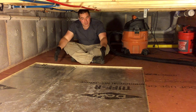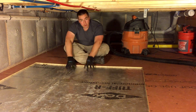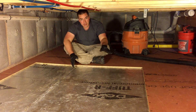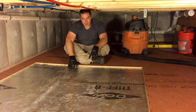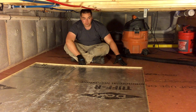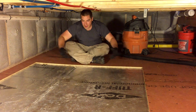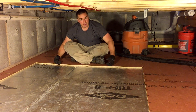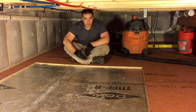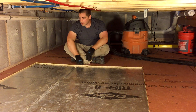Alright, check it out — this is where the tank's gonna go. We removed the OSB on the floor because it would have acted like a thermal bridge conducting the heat outward, and also because the edges of the OSB that's remaining on the floor is now going to act like a little bit more of a barricade, making it rigid on the bottom plywood that we'll be building for the walls. So this is great!